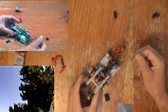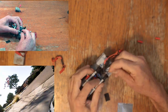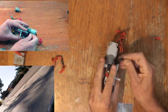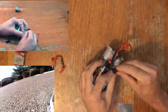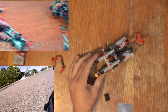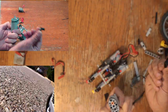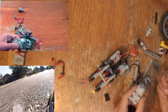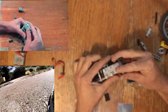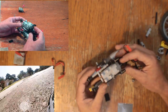Some of you want to know if you can use a LEGO IR receiver to do this. I'd say it's probably going to be really difficult to get it to work well — you're not going to have very much range, and you can't use a three-cell lipo battery so you'll have to go down to a two-cell lipo. That means less power, you won't be able to take it outside, and it's not going to be quite as good. It might be more difficult to make it work.